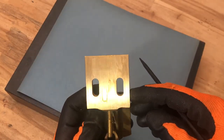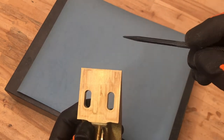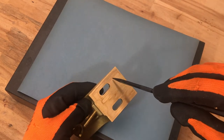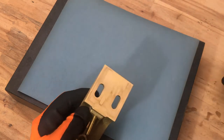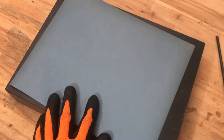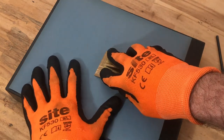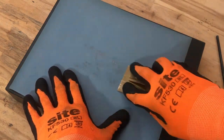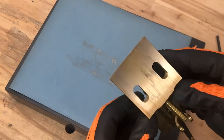The first thing we're going to do is have a look at the underside of the frog. There's definitely still grinding marks on it and a little bit of discolouration. We're just going to be polishing that — it's already flat, so to keep it flat I'm going to be working on this granite surface plate. To start off with, I've got some 2500 grit paper, just to give it a quick rub backwards and forwards so we can see what we've got. Just a few strokes will do it, and that's enough to give us a tell-tale of what's going on for flatness.